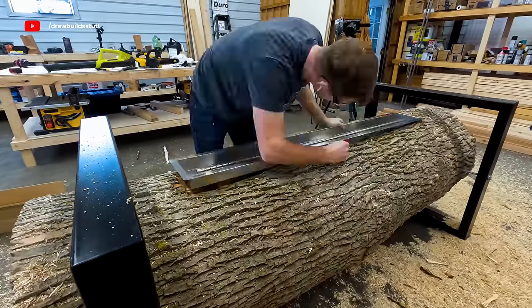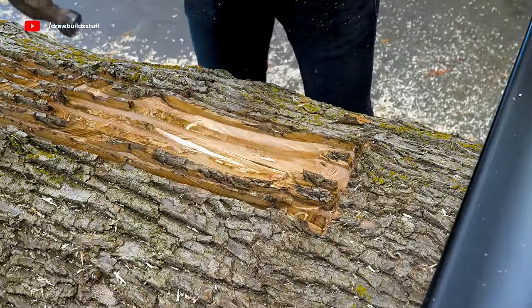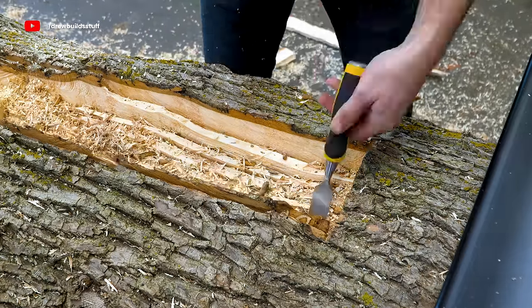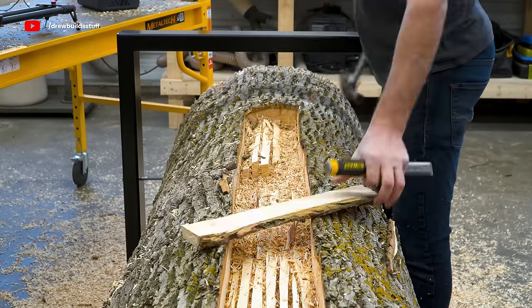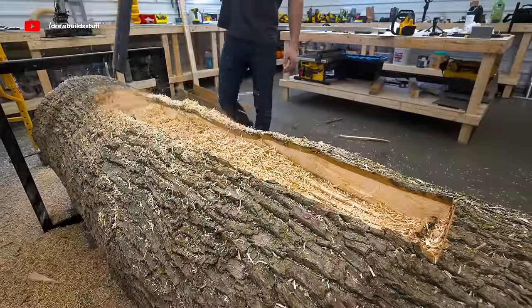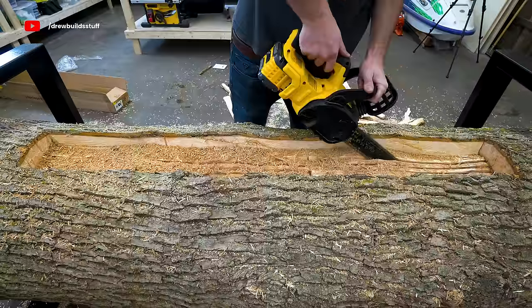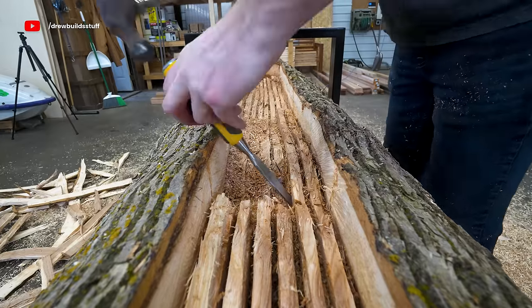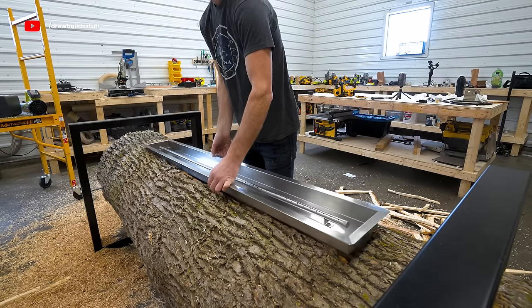I'm cutting the wood into thin strips inside the tracing. After a couple passes a few inches deep, I come back with a hammer and chisel to start removing pieces — the first couple are always the hardest to get out but after that you have more room to work and can pop the rest out fairly quickly. Carving the whole thing out took probably a couple hours. After my first passage I did a rough fit with the insert to make sure we were on track, then repeated the process to deepen the trench. After three passes I had it about four inches deep, which should be enough.